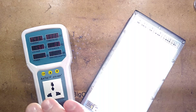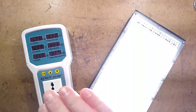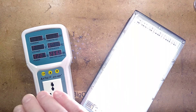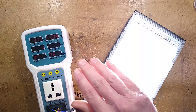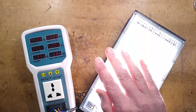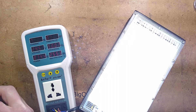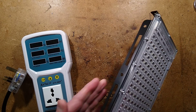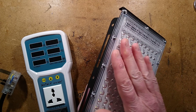It started off at 100 watts and now it's rapidly going down as it heats up. That is quite impressive — a lot of light, blinding actually. It's also very flickery, my apologies. The power factor is 0.89, which is pretty good. Current is 400 milliamps and it's currently at 88 watts. I can feel the heat off this as it thermally regulates. I shall unplug that because that is quite obnoxious. It's not too bad temperature-wise.